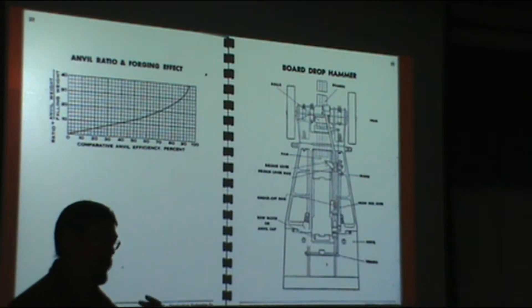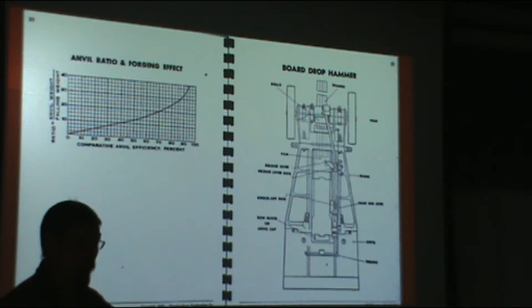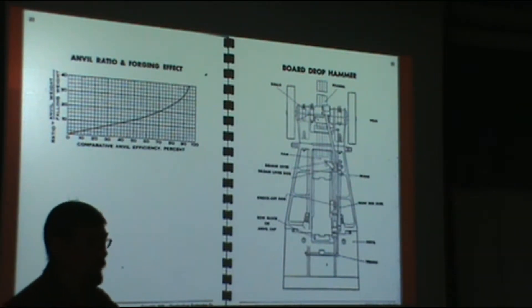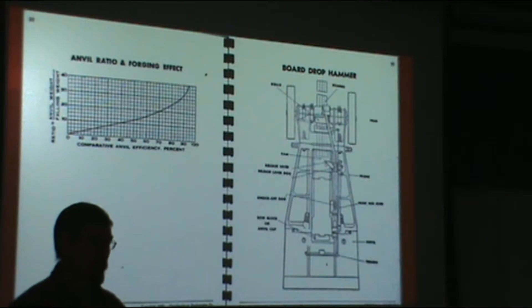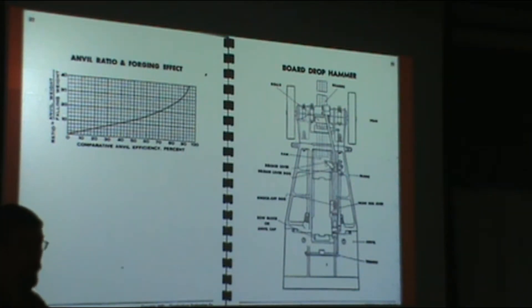That's very different than a press. In a hydraulic press, you don't have a big mass that has to resist a load — the press is a frame that holds everything together, so the ram pushes against the backside of the frame. In the case of a hammer, the anvil is somewhat independent of the rest of the machine and has to have enough mass to resist the blow without moving or breaking. When setting up a hammer, you have the big anvil, and underneath you have about four feet of white oak timbers crisscrossed — essentially a big cushion. Underneath that is concrete, which is really just there to keep the structure from sinking, not to resist the blow.